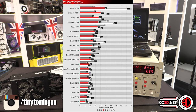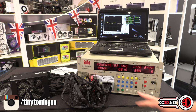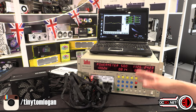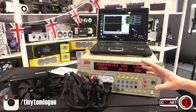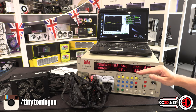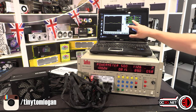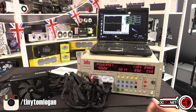I show graphs for efficiency and millivolts but I prefer to keep it like chatting with your mate at the pub. At 100 watts we're 89.4% efficient — it fluctuates a little above and below. I always report the middle value. For millivolts at 10% load, I saw a maximum of 9.6mV.